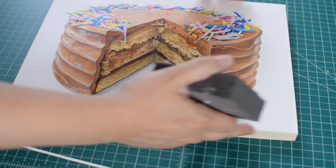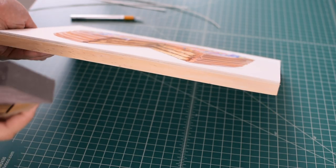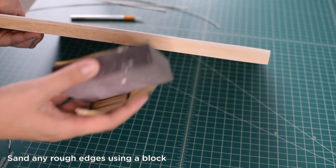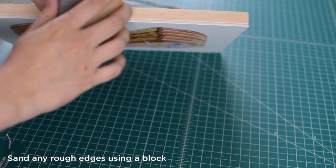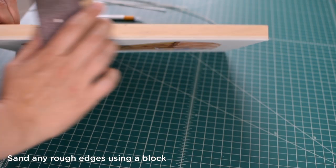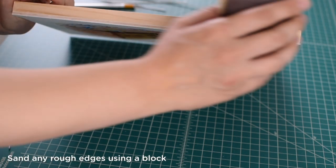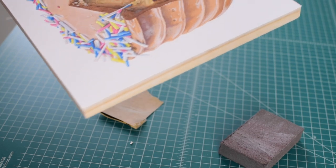I've flipped it back over and I'm examining the edges to see where there might be some unevenness or things that need to be sanded down. I'm going to pick up the piece and hold my sanding block here, and just very gently run it across the edge — this is a medium fine paper. Then I'm going to flip it and go back the other way on the same side. Avoid doing just a back-and-forth in the center, as that can wear down the center a little bit. You're mostly trying to take off the top edge of the paper and give it a really smooth, even finish so it's just as smooth and level as the board. Work your way around the whole piece doing that.